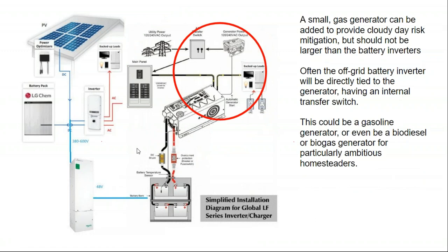And so I guess the takeaway from this is, with proper planning, we've always thought about solar as connect to the bottom of the bus bar for a load side connection, or connect to the top of the bus bar with a supply side connection. But now in off-grid design, what's really needed is an automatic transfer switch between the grid and the home to isolate the grid from the home. Although the cheaper version is a manual transfer switch instead of an automatic one, even the manual transfer switches are expensive. And sometimes your local authority will want you to still have a visible knife switch disconnect on top of an automatic transfer switch. So I don't know.